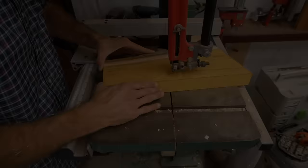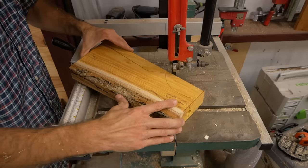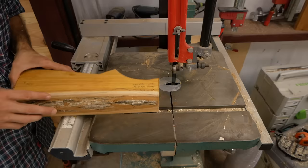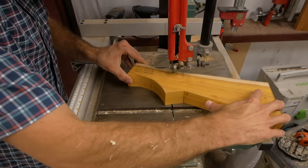The next step is to cut out the rough shape of the stock. I just traced the old one — it's the easiest way to do it. I have a half-inch blade on my 14-inch bandsaw, which is actually too wide for these curves, but I'm just making it work. A lot of times I'll use the big Oliver for this since it has a smaller blade, but changing blades on the Oliver bandsaw is quite the procedure, so I didn't want to get into that. I left some sapwood on top hoping for a nice accent, but ended up shaping it off.